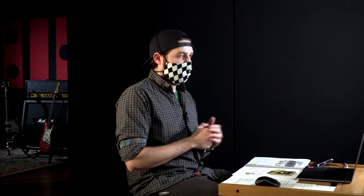Why do we keep harping on this? If we were building a ukulele kit we would not be talking about this. Even a pedal kit — you're only working with roughly 9 volts at most. In this circuit we're working with 500 volts of DC, which is enough to stop your heart. It's really important to talk about it anytime we're going to be working in a live amplifier, which we will at the end of this episode.